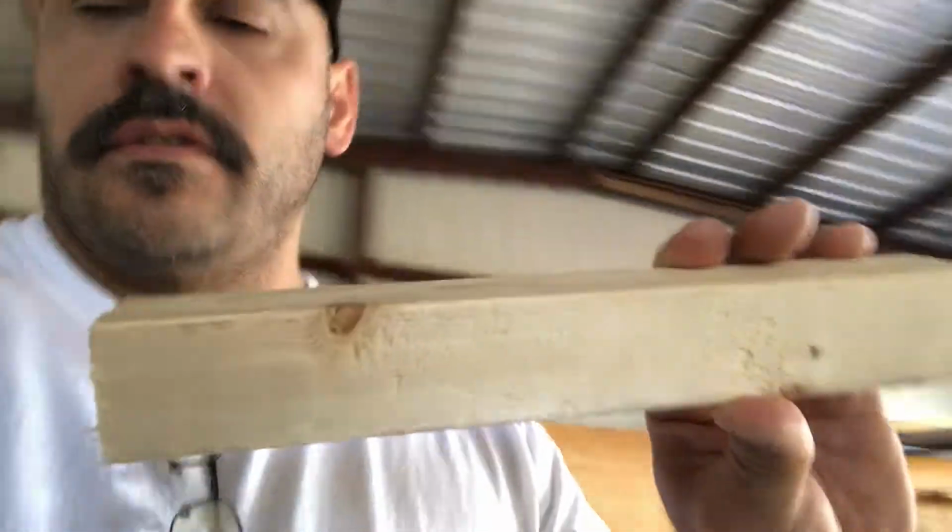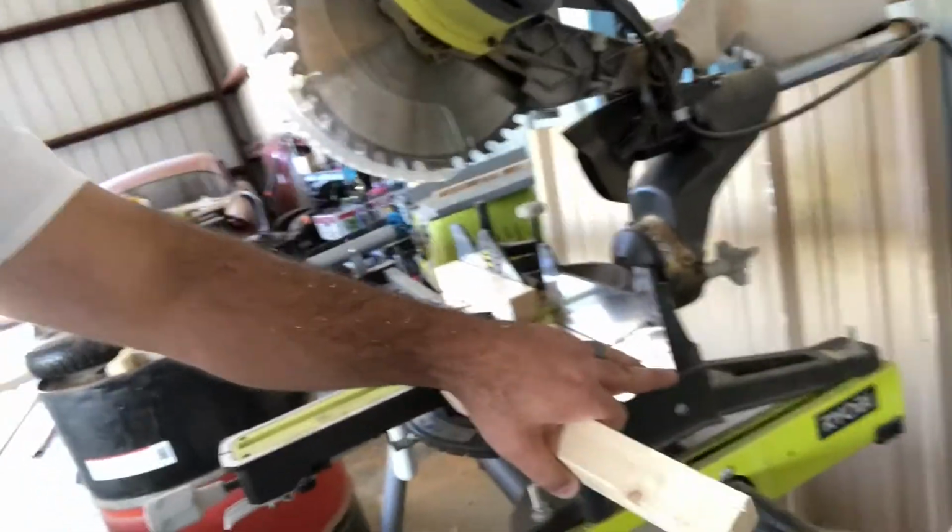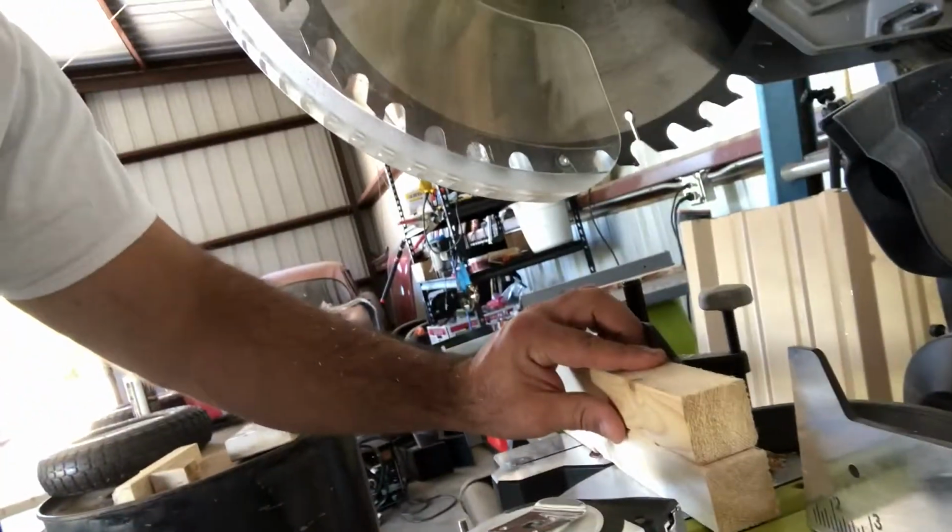So I cut too many, but I didn't really, because I'm gonna make nesting boxes on the other side. So really I need double the pieces. When I'm making a lot of the same cuts, I measure and remeasure and just double check it, slow down. The first piece, 10.5 inches, I measure that. And then for the next piece I take that first piece, stack it on top, flush up the end. It'd be like this.